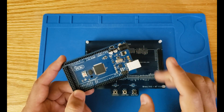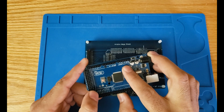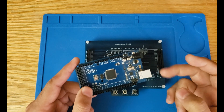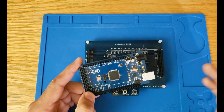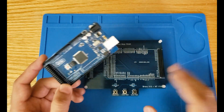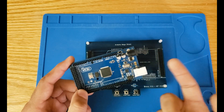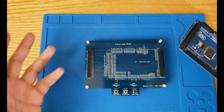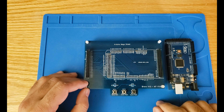Of course, the output power from the Arduino Mega is not that much, and when you stack more than four or five modules it won't be able to power up the whole system. By that point, we'll have the main power source for the computer and will switch to a different power source. There are different ways to power up this computer and I'll talk about those later. But for now, when testing one, two, or three modules stacked together, we can use just the power coming from the USB port via the Arduino Mega. This system is kind of self-sufficient and you don't need any other power supply. See you in part three of the project.